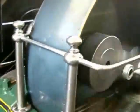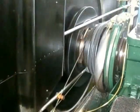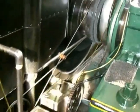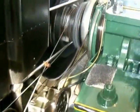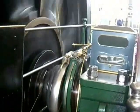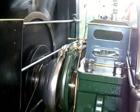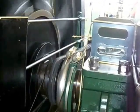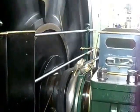This is the back of the flywheel — there's the crank. Looking around the back of the crank, we have some intriguing auxiliary equipment. The two eccentrics there are for operating the valve phasing, and there's a drive belt — the brown drive belt — powering these lubricating oil pumps. They're pumping oil to the header tank system. You can just see oil dripping out of the two drippers into those pots, and then into the eccentric — that's how they are lubricated. Every part of the engine is lubricated by a forced drip lubrication system.